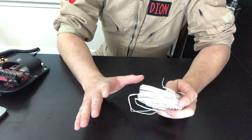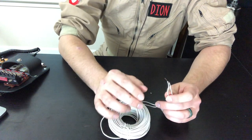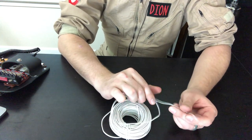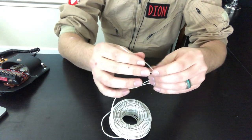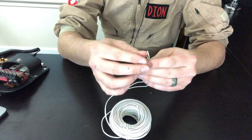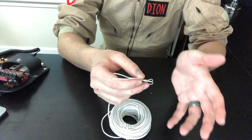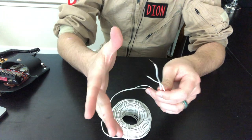One thing I neglected to mention is that with the Nixie wiring I was not supplied with enough additional 2.5mm tinned copper wire. What I had to do is use some audio wire I had from my proton pack build — I split it, stripped it, and measured it out. Luckily the diameter was exactly the same and it worked perfectly with the same malleability. Just be aware that if your kit doesn't come with enough, there are other options and you might have to improvise.